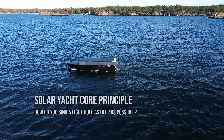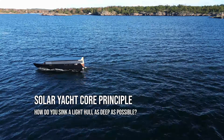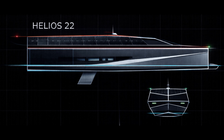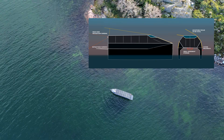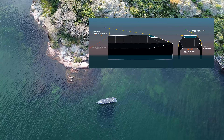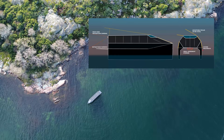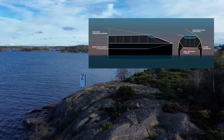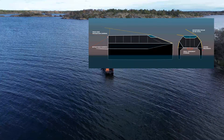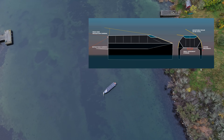So the new design question became very simple: how do you sink the hull deeper while keeping the total displacement low? That leads toward ultra-narrow monohulls with extremely low centers of gravity, or ultra-narrow catamarans that move more like trains than boats — ignoring medium waves and chop, remaining light, and requiring minimal power to cruise. That's how you really get racing-level performance with relatively modest power inputs. Above 20 knots on around 40 kilowatts becomes realistic when the geometry is right.